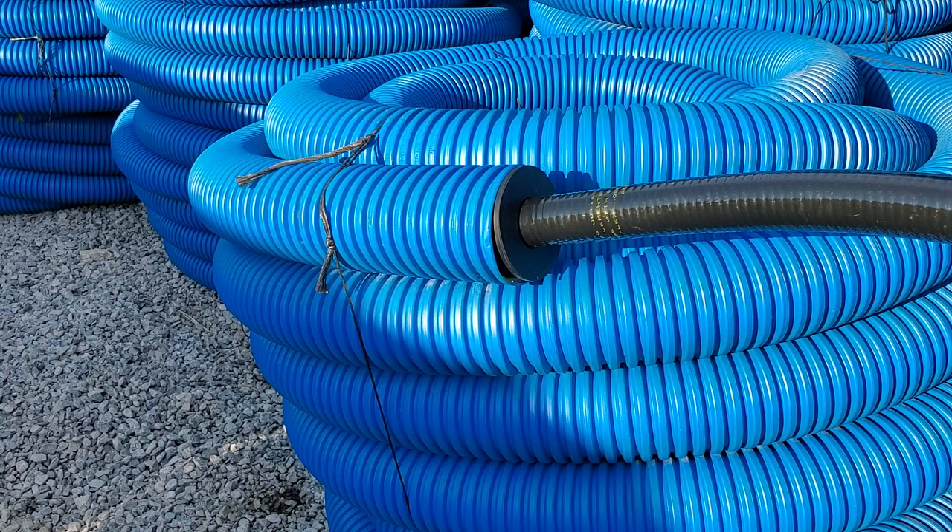I like the one-piece schedule 40 inch-and-a-half discharge line. I like it because it's glueless, fittingless — leak-proof. You don't have to worry about joints cracking or roots getting in at the joints. I prefer the inch-and-a-half flex and this bushing, taking it all the way to the point where I'm finally up at the crest.